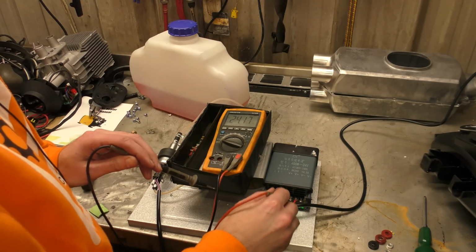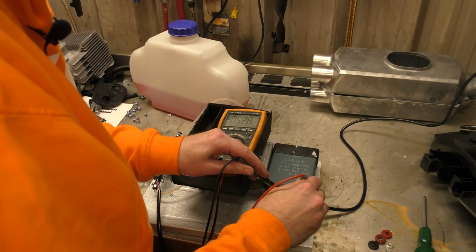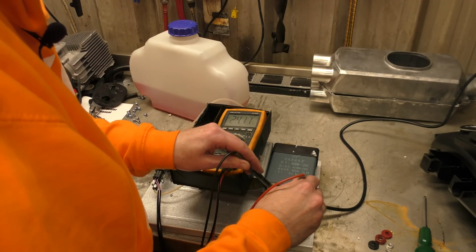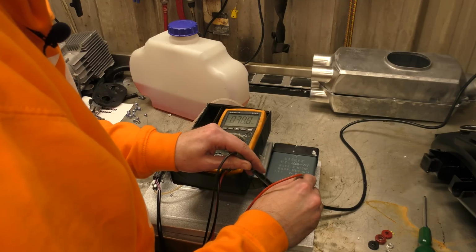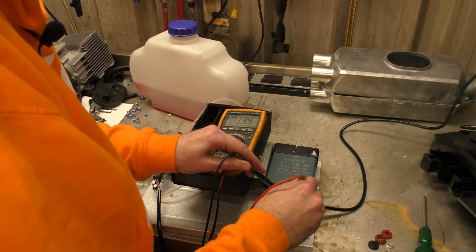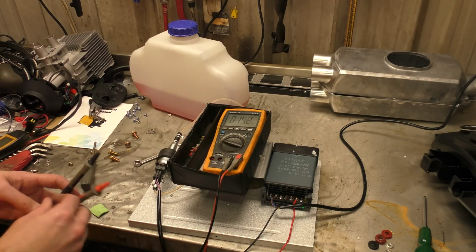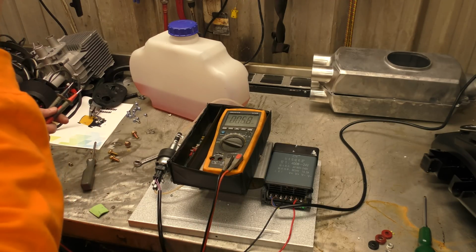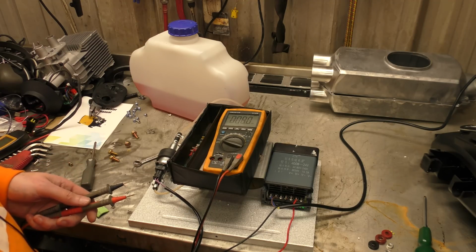And that is absolutely the ground side. That positive, negative, positive, negative. I mean, it is 24 across the board, apart from there, because there's nothing in that one, that's empty. That's still two negatives. That's positive, negative, and that is the correct polarity. So how on this great mother of God are they powering this heater with 24 volts?